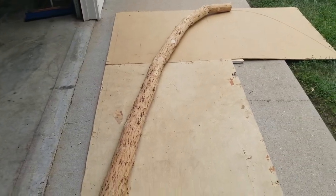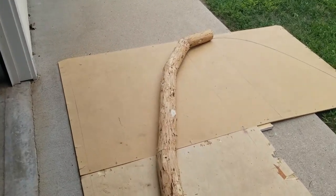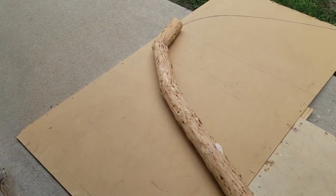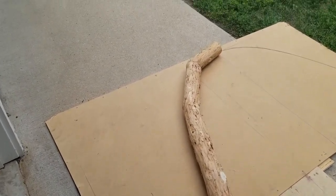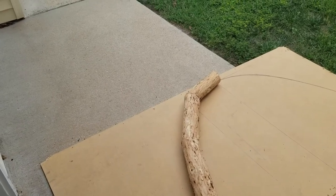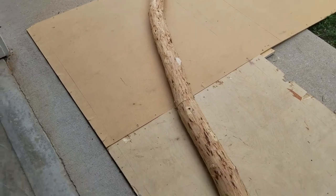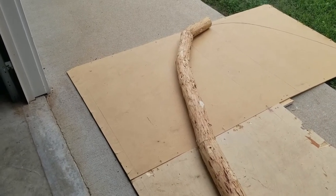When this is in place, reinforced and supported, it'll be very strong — super strong. The reason this will be so strong is shown by the line underneath on the pattern it's sitting on top of. That line represents the force line, so just like stacking one brick on another, gravity pulls all the force we put onto this arch straight down along that line. I believe this is a superior way to build as far as strength is concerned, and it conserves resources quite well.